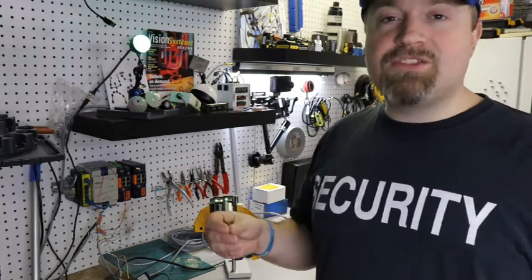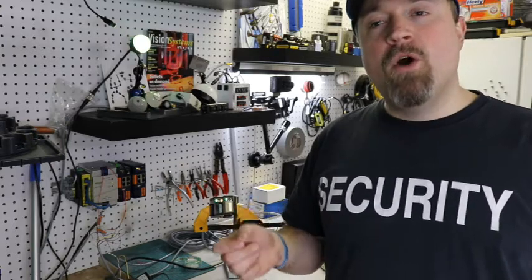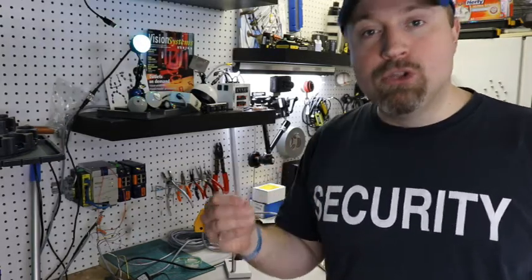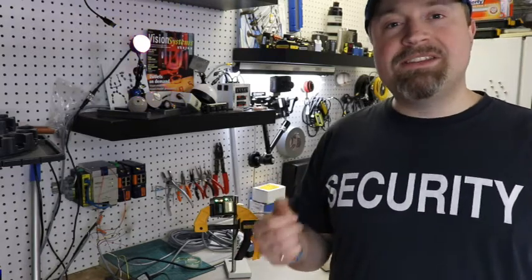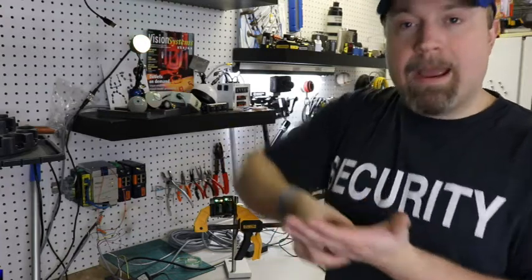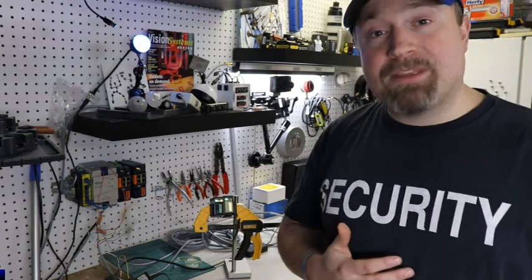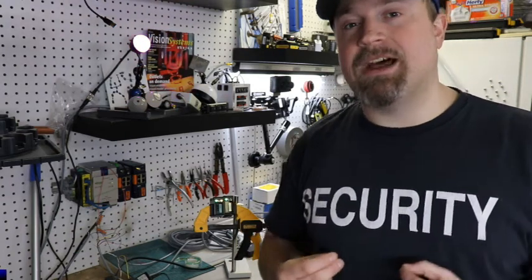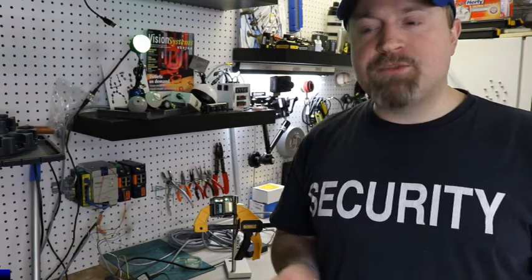Now, in applications where I need to determine what the delta height is, for an example, I need to know what is the height of a glue bead relative to the surface I'm dispensing it on, or what is the overall height of that surface relative to a part I'm pressing into a fixture that can move up and down. A lot of these applications, I need to know what the delta height of that part is to know if it was assembled properly. Another option is webbing.